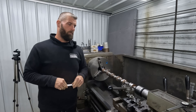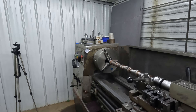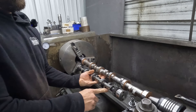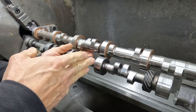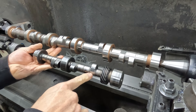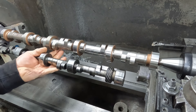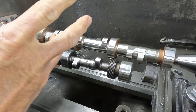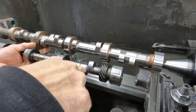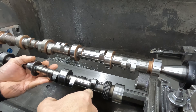What that's doing — what that's allowing to happen — is related to the size of the lobe. This lobe here is designed for a 55 millimeter. This lobe is designed for a standard journal in a small block, but this is a 900 base circle. This is a huge solid roller — mid 600 lift, 270-ish duration. You can see how small this lobe is compared to that lobe. The problem is the smaller this gets, the further the lifter is going down in the lifter bore, and as it has to come up the main event, the pressure angle is just extreme.